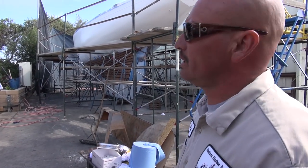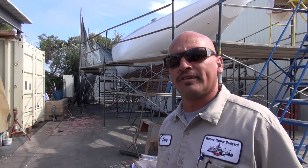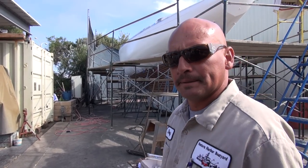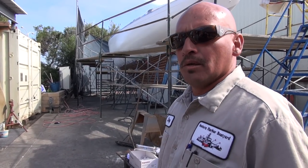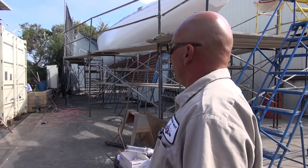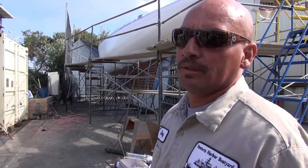Great. So basically, after today's shoot, you're looking at a total of six mixed gallons on the hull side. So after today, you will have put six total gallons of paint on the hull. Yeah. And do you think in terms of actual volume on a hull of this size? Or do you just know you need six coats? No, for the simple fact that it was down to bare wood, we're sealing it up and getting the proper millage on it as well. From the specs from AwlGrip. Okay, and so in the future, when you're doing paint jobs, we won't take it down to the bare wood anymore. No. This is a one-time deal once we start off from bare wood.